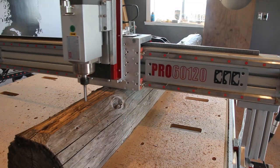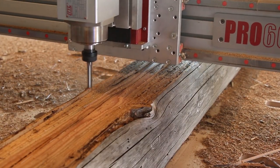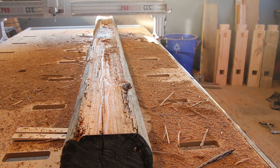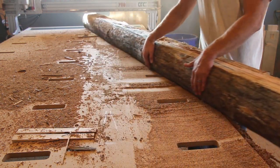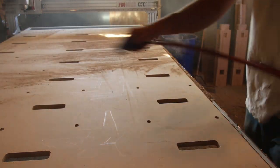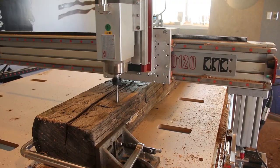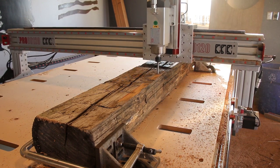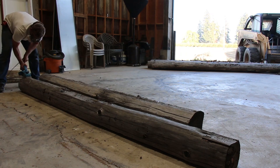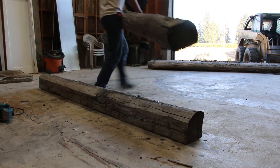To mill the logs, I made a pocket the same size as the log and set it up to take quarter-inch cuts with the half-inch end mill bit, which was the widest I had. Looking at the end of the log, I figured out where the best five inches in the middle was and milled the top side down to that point. Then I could flip the log over and mill the bottom side down to the five-inch mark. I really didn't want to use the chainsaw again — it just took too long and was a real pain. A couple of the other logs were just barely too tall to fit under the gantry, and I was able to make them work just by hitting the high spots with the planer.